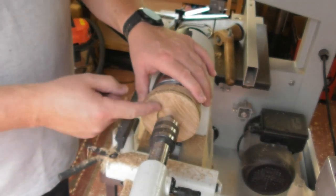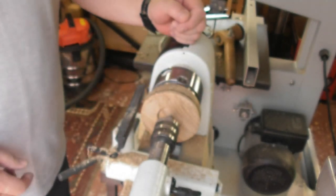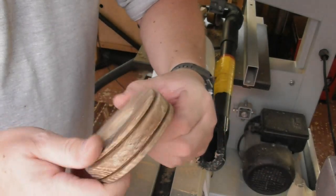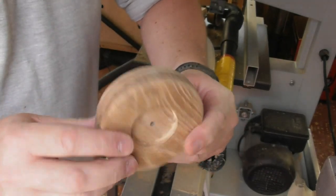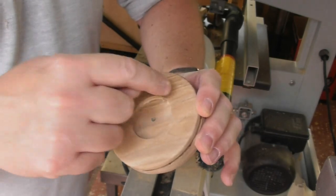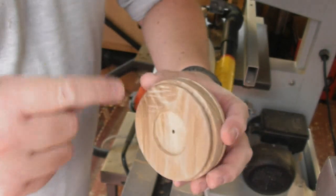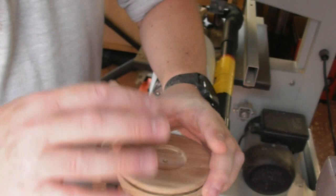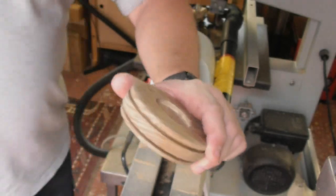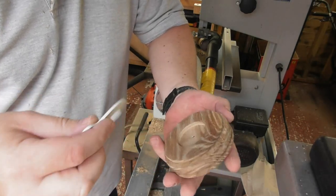Once I've got those to the right dimensions, I can put a little curve and finish off the top, then turn it around and finish off the bottom as well. Apart from finishing, which I'll do in a moment, we've pretty much finished the turning. The only thing I need to do is finish drilling the 45 millimeter hole out of the center, mark the two pilot holes, and then bolt the kit onto the top. But before we do that, we can actually check that this fits on the jar — and even if you're not fitting a coffee grinder, you can make quite a nice wooden top for this type of jar anyway.